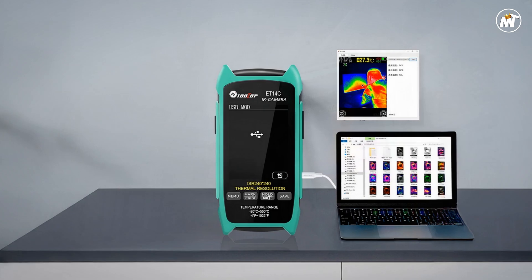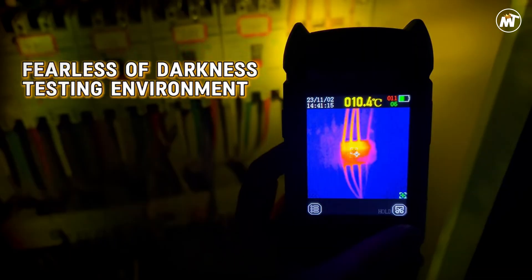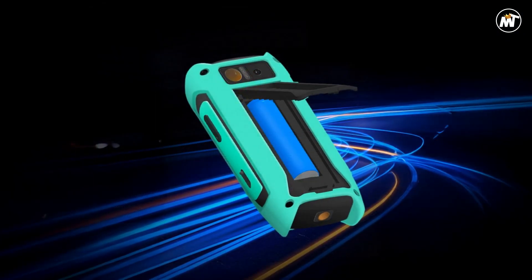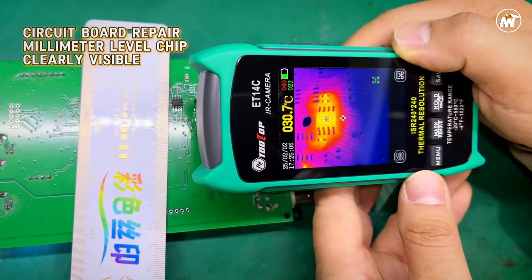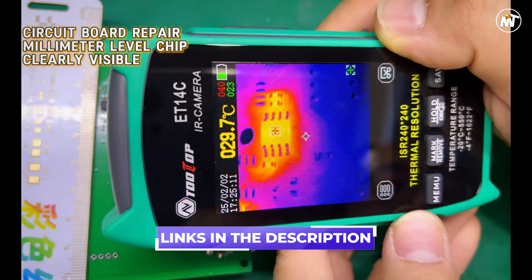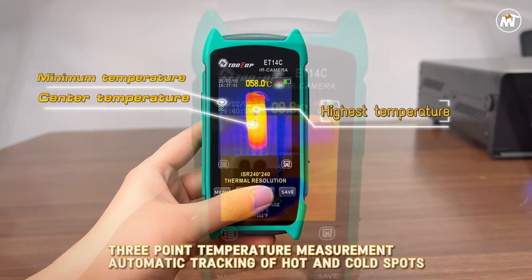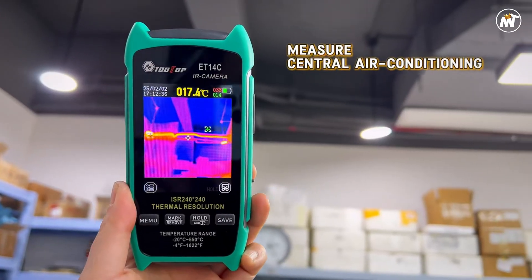From iron red to rainbow, fusion, and white heat, you can switch through multiple color palettes to highlight temperature differences with precision and style. The auto-gain mode intelligently adjusts brightness and contrast, ensuring your visuals remain clear even under challenging lighting or temperature conditions. The optional macro lens is a true game-changer, designed for close-up inspections at about 2.5 centimeters. Simply slide the lens left or right when needed, and remove it instantly to return to normal thermal imaging mode.